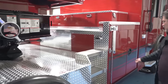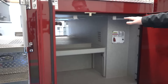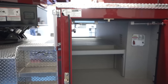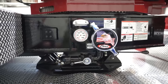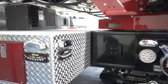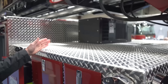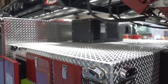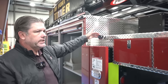Coming to the rear of the tractor, this compartment will house most of our medical equipment. We'll have plug-in capability for 12 volt, and our cab lift controls are there as well. There's an intake on either side — since this truck does not have a tank or pump, we'll rely on another pumper to pump water through the aerial waterway, and that's where we make that connection with an elbow. We've got a 6kW Harrison hydraulic power generator that powers the tiller cab air conditioner and a couple of receptacles in the trailer. And finally, we've got our 360 camera, which will let us see exactly where our stabilizers are going to come out and land once we go to set the truck up.